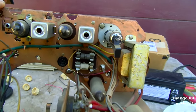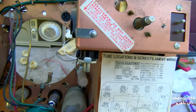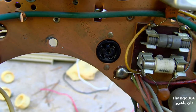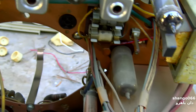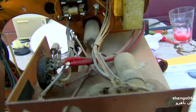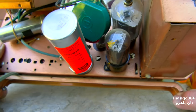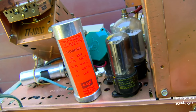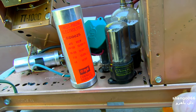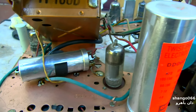This uses a voltage doubler off the line. Those right there in sockets are the rectifier diodes — I know they look like fuses, but they're the rectifier diodes. The fuse is socketed and it's right there. We have test points — this is a test point socket. Would you say that's an aftermarket replacement? This one might have been replaced too — it's awfully shiny. Is that the original Motorola damper tube? This is definitely a low-hour set.